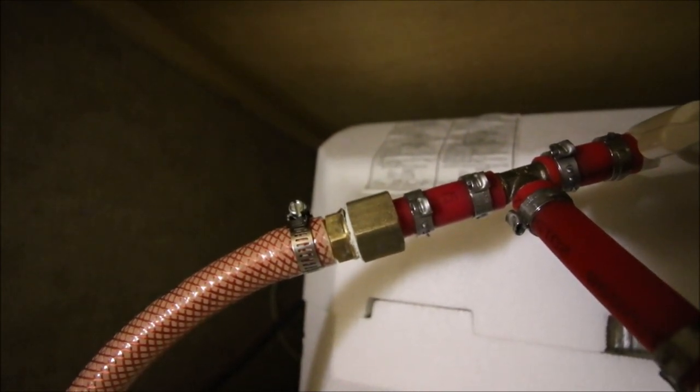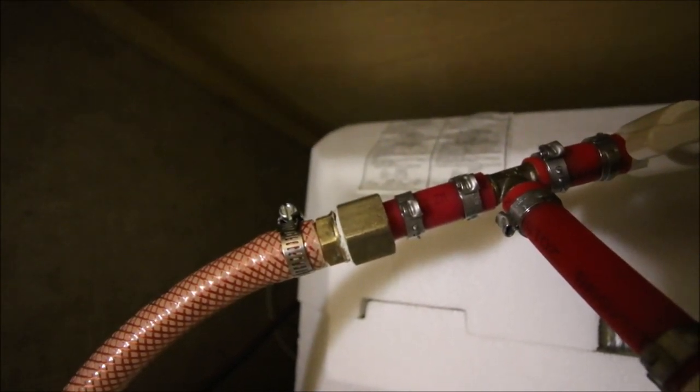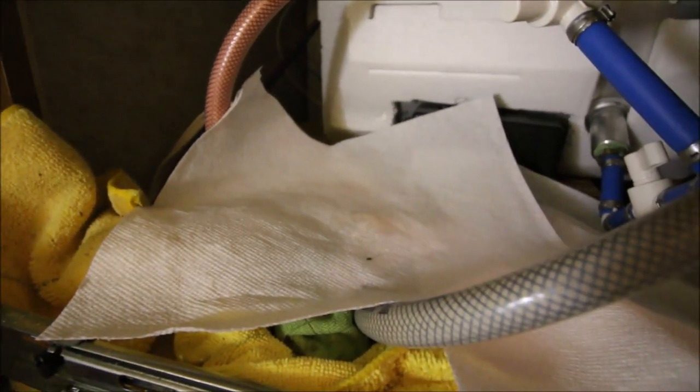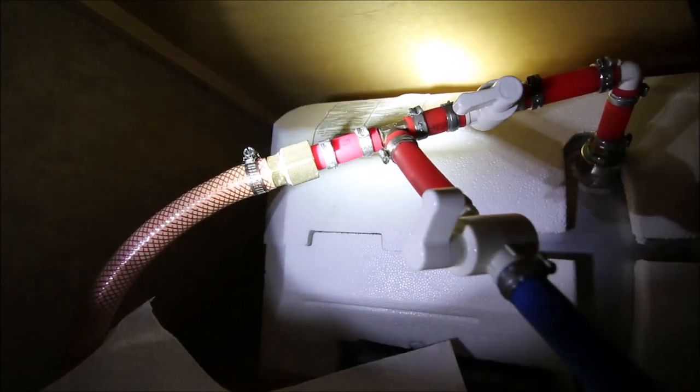We're going to power up the water supply. I'm going to close all my valves and fire up the water supply, and we'll monitor it. I've got some paper towel under it — paper towel will be a kind of a telltale as to whether this thing drips over a long period of time. If it's not dripping now, the paper towel stays and I'll monitor it for several days afterward just to make sure it didn't leak. I've got full water pressure on it now and there are no leaks and it's good and tight. I do not suspect it's going to start leaking.